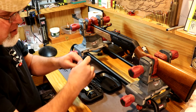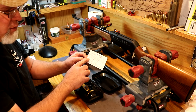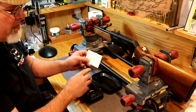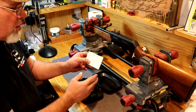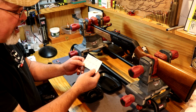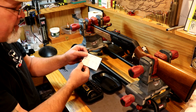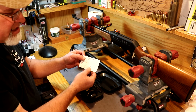It comes with a little calibration sheet telling you the torque settings. For example, the target was 10 inch-pounds, the lower limit is 8, and the upper limit is 12 — a range of about 4 inch-pounds. This one tested at 8.6 inch-pounds. At 30 inch-pounds the range is 28 to 32, and this one tested at 30.7. At 60 inch-pounds the range is 57 to 63.